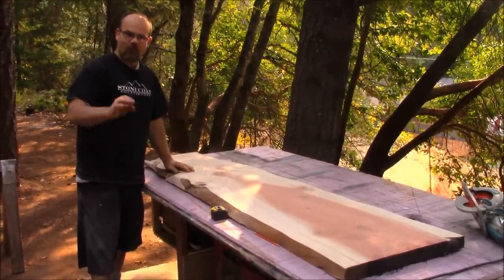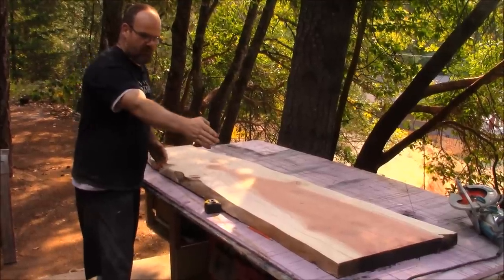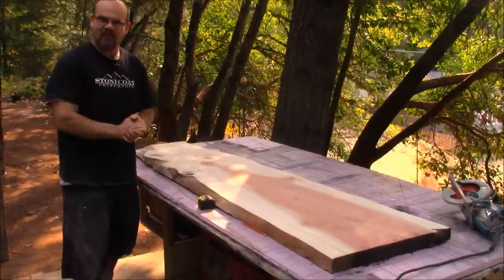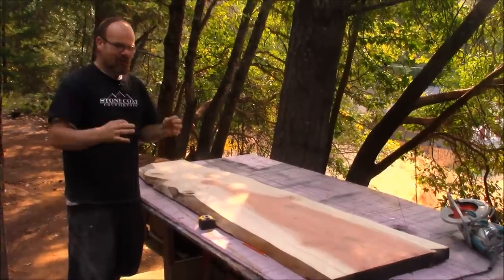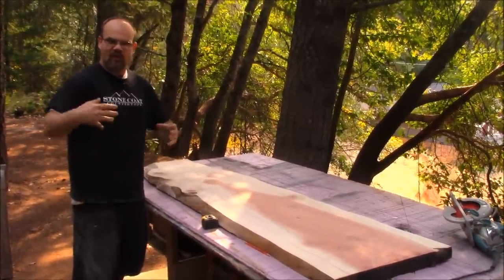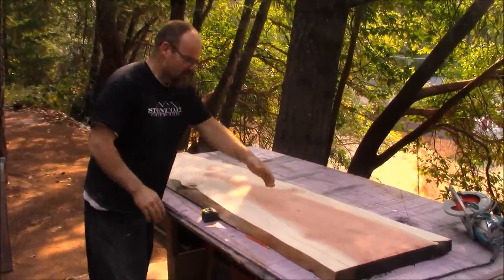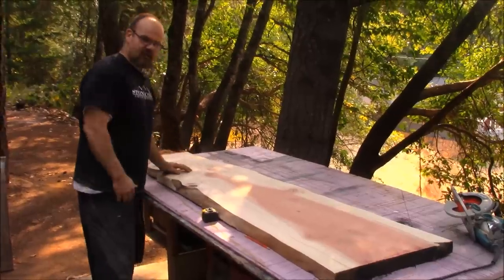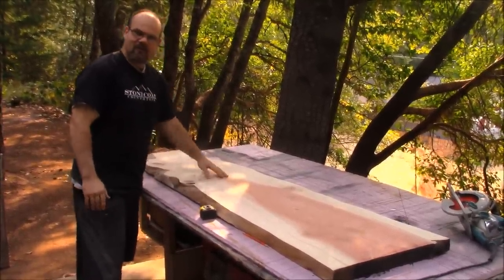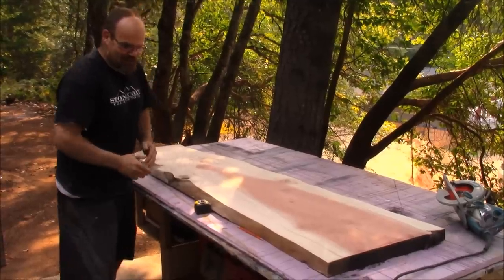We're going to take this piece of redwood and turn it into an amazing table. Right now it's a smaller piece — about 23 inches on the wide end and about 19 inches on the short end. We're going to add some width to this and make a river of epoxy, a really neat artistic element. It really brings nature into a modern element. We're going to cut this piece of redwood right down the center, make a couple center marks, give ourselves a straight line, then take our skill saw and cut right through the wood so we can flip it and the live edges become the template for our river.